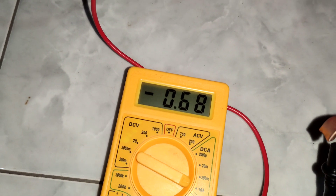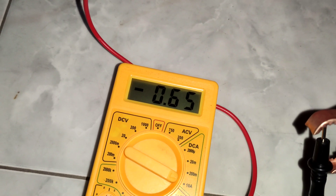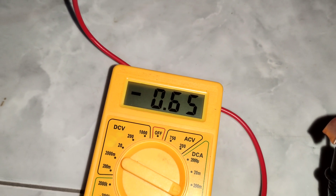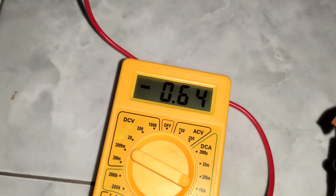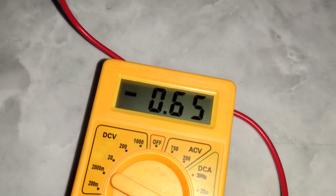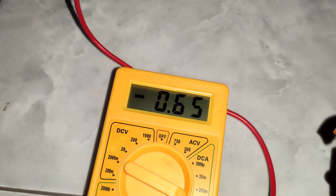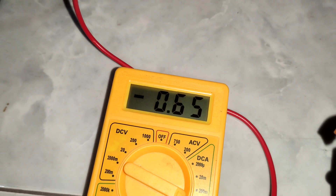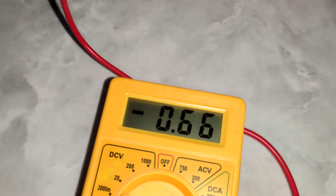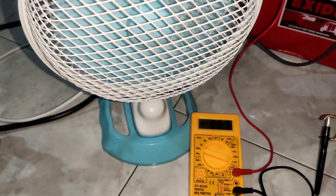Just keep the power button off but let it charge. This is a 35-ampere-hour battery, so doing a direct calculation, we'd need more than 35 hours to charge it at this rate — that's inefficient. If there is a daily power cut with only one hour of charging, the battery won't recover fast enough. We need a separate dedicated charger to quickly charge this battery.